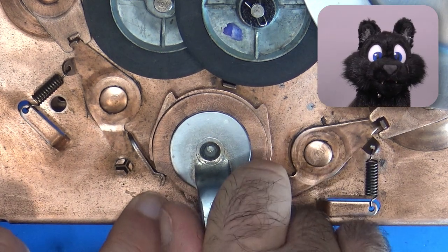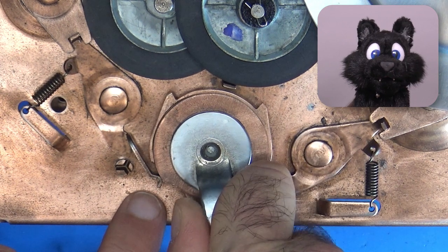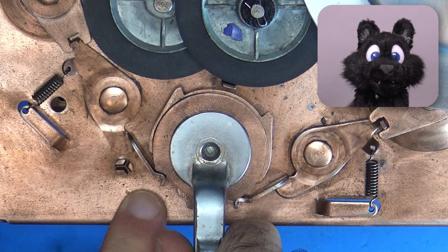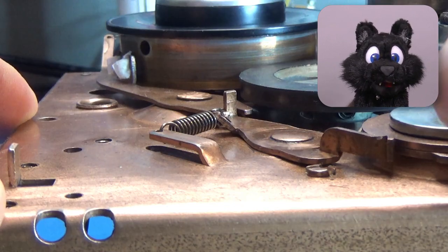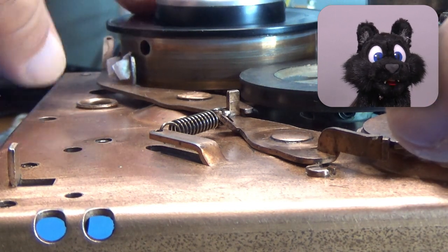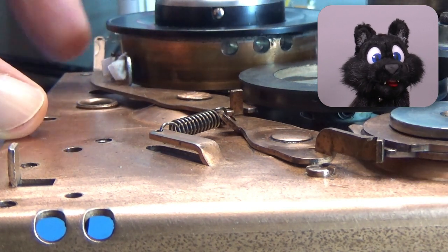The play control lever has another set of cams on it, which operate the brake mechanics. Both of the wheel brakes have three positions: a soft brake, which is basically tensioning the wire during transport; a hard brake, which is stopping the wheel; and a third open position, to prevent drag on the driven wheel.